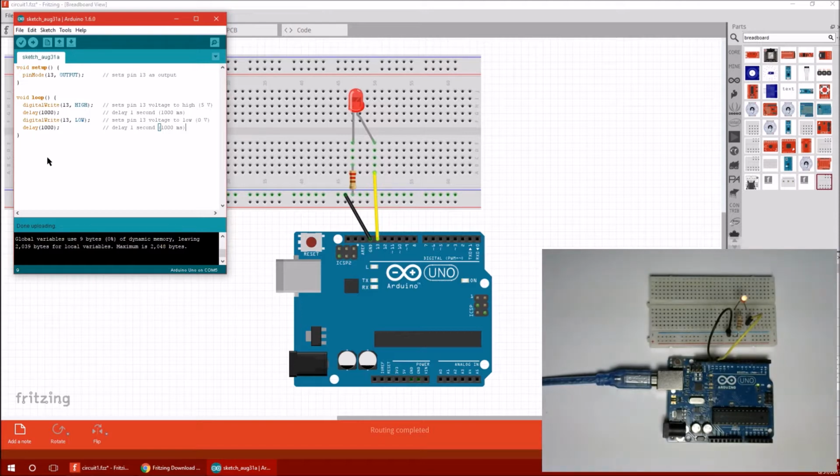Oh, yes, we do. I forgot where I was looking. There it is. Very nice. Now, I don't know if you can quite see, but there's actually an LED right on the board, right near the GND and the L. The Arduino boards actually have a built-in LED on pin 13, and that's just for situations like this where you're just practicing. So it turns out you don't even need to build this little circuit to practice this program. Maybe I should have opened with that, but that is why I'm using pin 13.